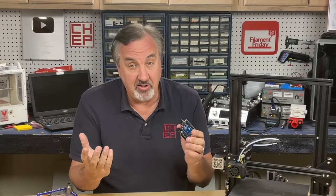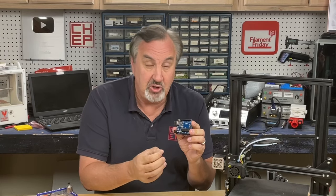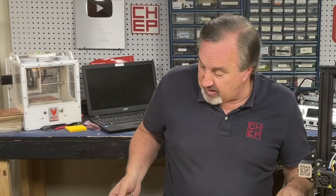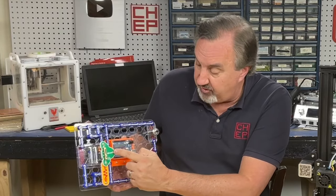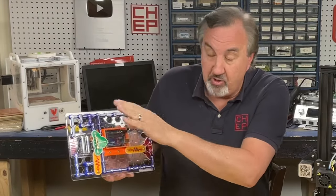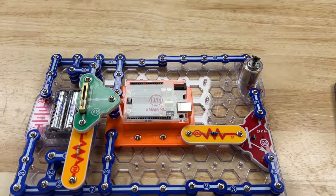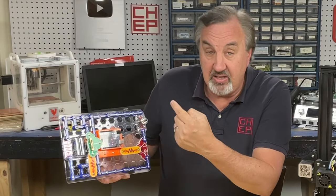The third function is analog to digital conversion. The microcontroller has special circuitry which converts an analog voltage to a digital value — you just have to pick the right pins. Once you have that digital value, you can use it in your program to do different things. Here's an example: I have a potentiometer, and as I slide it, it changes the voltage on the analog pin. When it gets above a certain threshold, the program drives the motor on; when it's below, the motor is off. So as I slide it up, the motor turns on, and as I slide it down, the motor turns off. It's an analog voltage getting converted to digital, then driving the digital output pin.